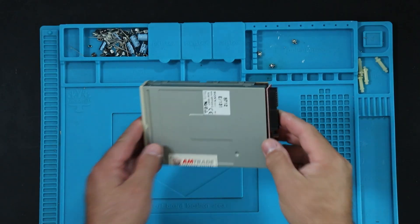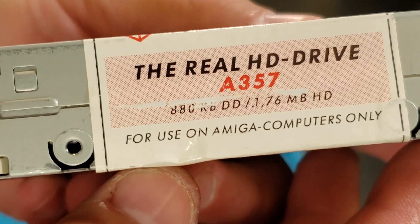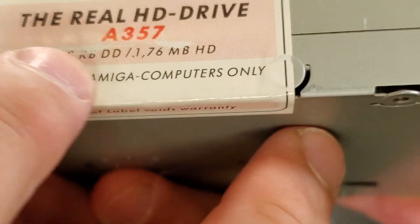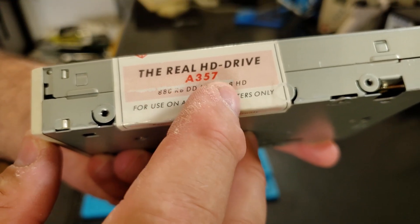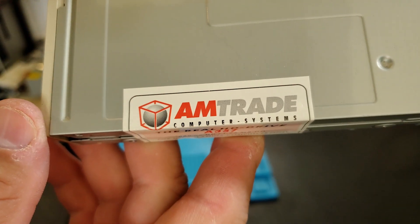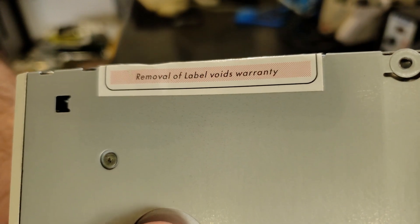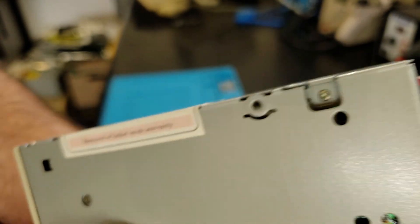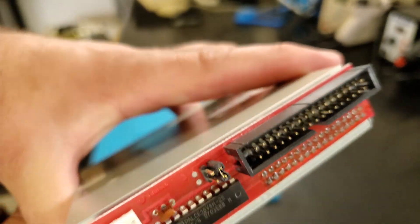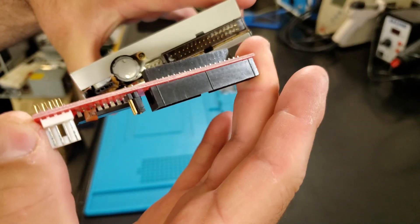Floppy drive time. This is an interesting floppy — the real HD drive A357 for use in an Amiga computer only: 880 KB or 1.76 MB. Made by Amtrade. I am going to void my warranty. It has this interesting little board on the back — clearly a PC drive modded to work in an Amiga — and that just pops right off.